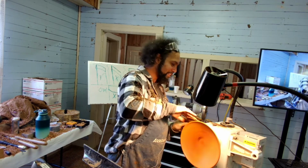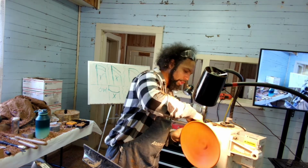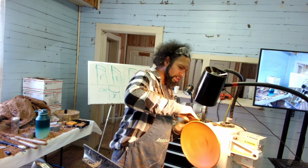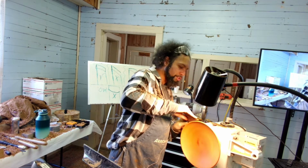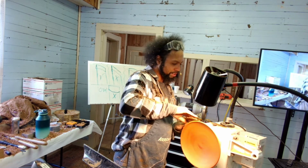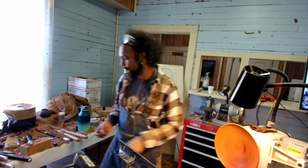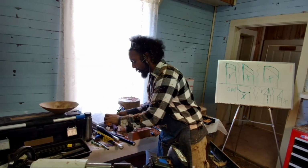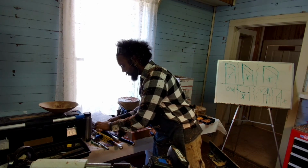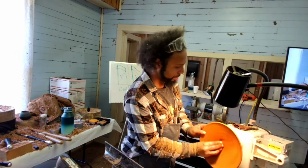All right, guys. Just about there. So a couple grits you can see, and these are very high grits. This is 220. So 180, 220. If you can sand up to these two grits, you're in good business, and you're cutting really clean. That's what this means. So it should feel nice and soft and smooth. It does. Put a little bit more oil, and that'll be good. Let's slow this down. 220, or yeah, about.